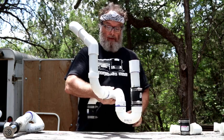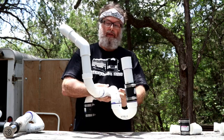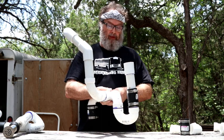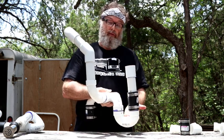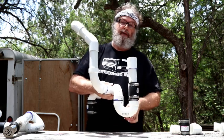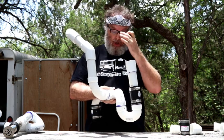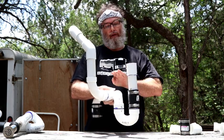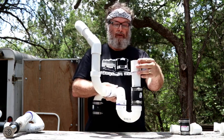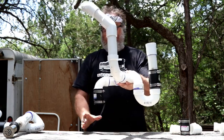This is the fitting from the shower and this has a P-trap — an inch and a half fabrication under the bus for the shower. You can see it's pretty massive. The chances of this drying out or sloshing around are just about zero, so the shower will drain into here. This is a fitting that goes on the drain of the shower, down, through the P-trap, across, and into the tank.